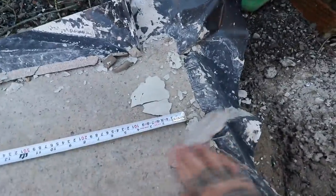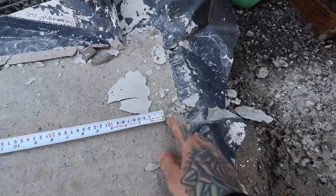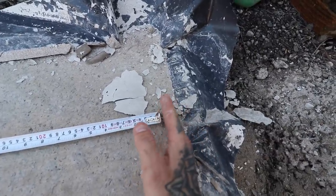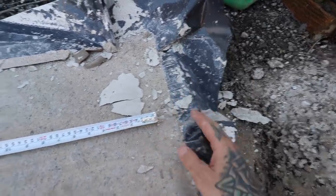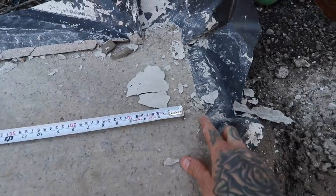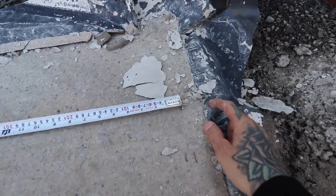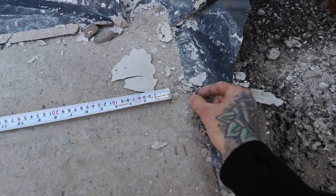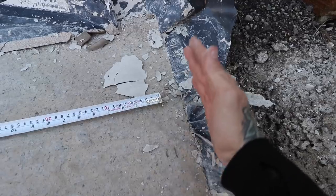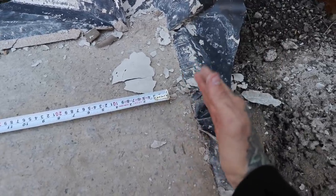But what I'm actually going to be doing here on this outside wall is 18mm OSB board, then a batten, and then I want my cladding to run off the slab, keeping it super dry. So what I'm working out is how thick that's going to be. I'm using some super thin concrete cladding. It's composite and only 8mm thick, so that's so minimal that it's not even included. And then the bottom piece I'm going to run straight off, so it's super sealed and tight.